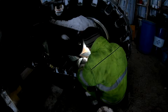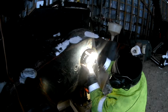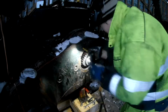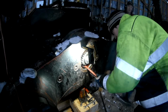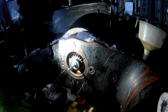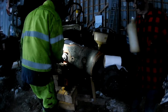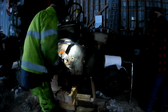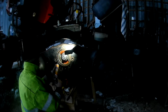Checked the plugs on the other bogie also. Nothing on the magnets there, so that's good. With the parking brake removed, it could be moved or turned a little and it started sliding in. Here the bearing behind it didn't really want to go in evenly, but a little crowbar and being able to straighten that up and tapping it all the way in. The bolt was removed, some silicone added, and the lid was put back in place. Bogie was refilled with oil.